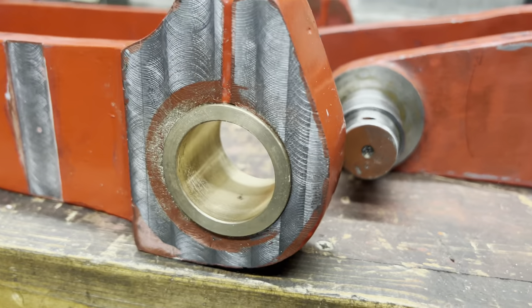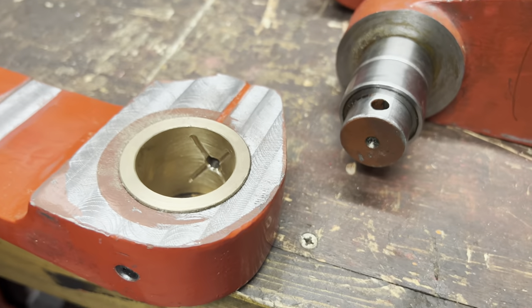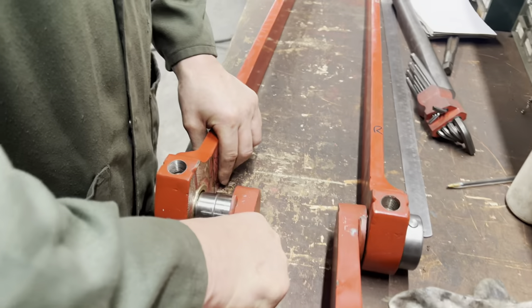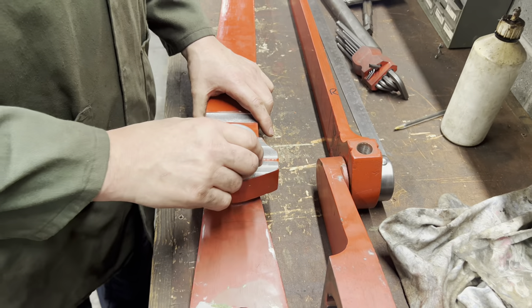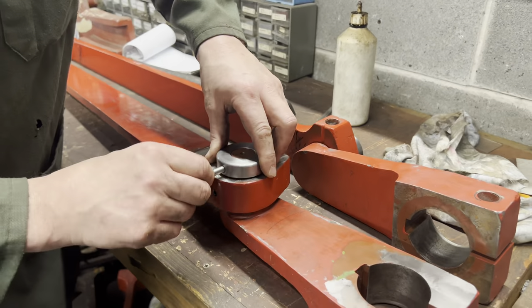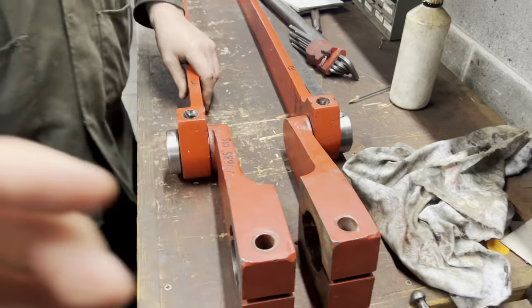We've made new bushes in the end of the eccentric rod, again with crossed oil pathways and a grub screw pin to stop it rotating and keep the oil pathway in line with the hole in the top of the rod. You can also see that some of these rods have flat spots skimmed on them — we've done that on all the rods. Those flat spots allow us to clock them up absolutely flat on the milling machine so we know everything is square and in line. They're a little unsightly at this point but will get filled and painted afterwards — you'll never know they're there. Again, a collar and a pin.